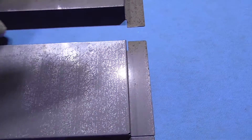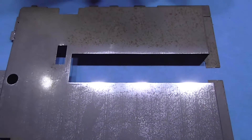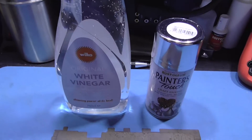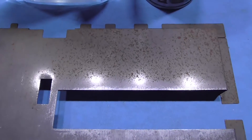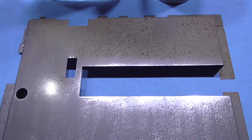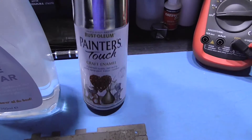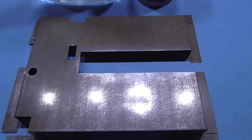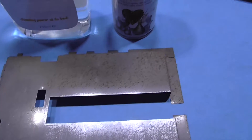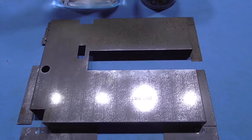I've cut the little hole — it just allows me to wire the 50-60Hz and go out the side of the case. What I need to do next is soak this in white vinegar and that will get rid of the rust. I'm going to leave it for a couple of hours while I do the mod and that will get rid of the surface rust. Once that's done I'll clean it with isopropyl alcohol and then give it a coat of paint to create an air barrier so the rust doesn't come back, because if I just left it, it's going to rust again.